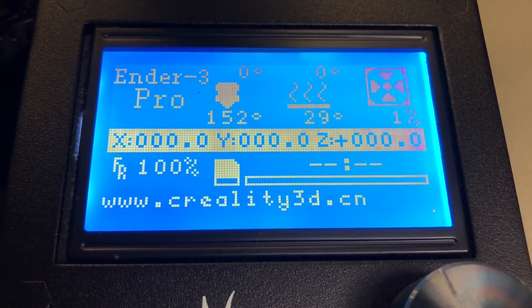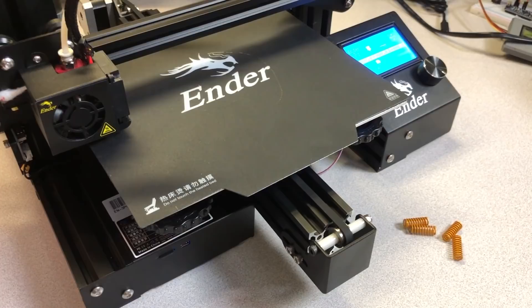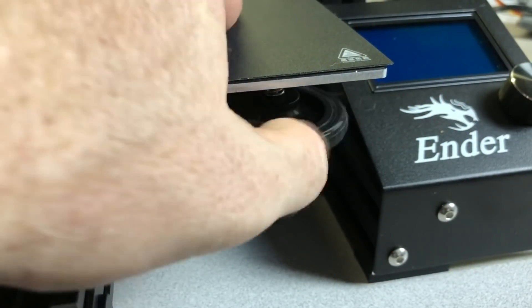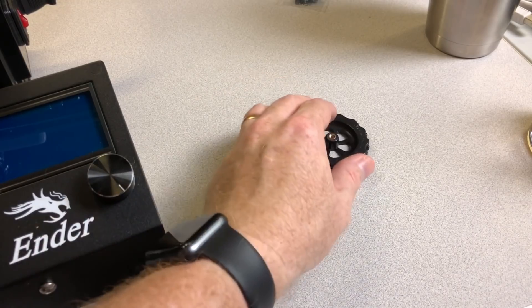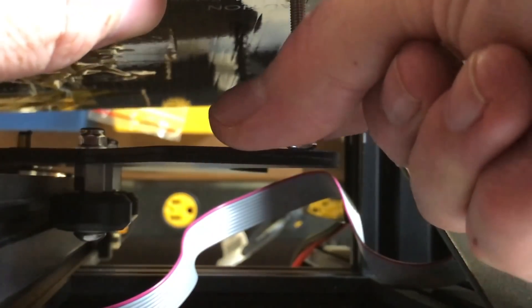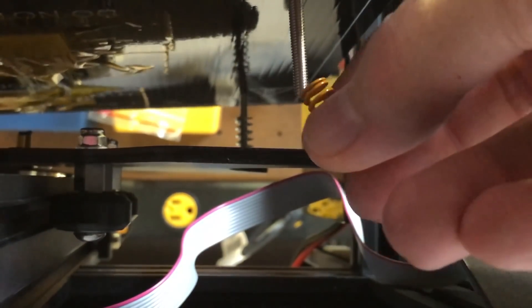You can watch the nozzle temperature on the LCD screen. While you're waiting, get four of the new springs ready and set them next to the printer. Once the printer has cooled down sufficiently, turn it off. At each corner, turn the adjustment knob clockwise to loosen and remove it, then set those large leveling knobs aside. Now we're going to replace the springs one at a time at each corner — lift the corner up high enough to remove the old spring, then slide on one of the new yellow springs. Replace the remaining three corners the same way.